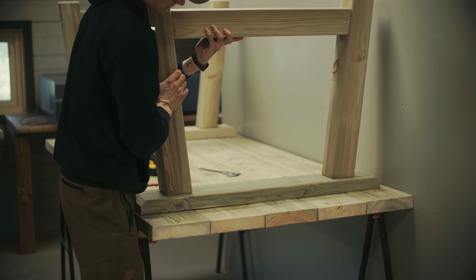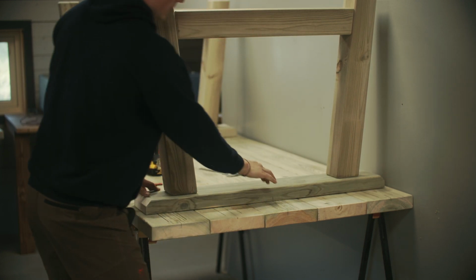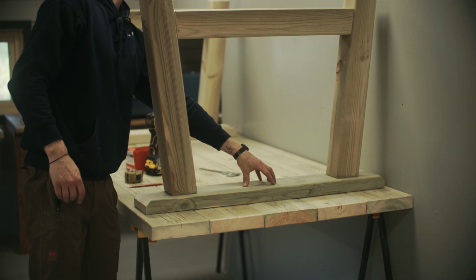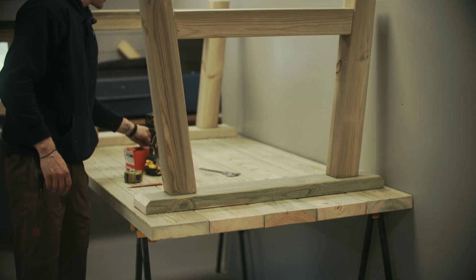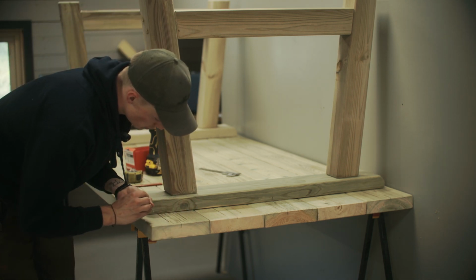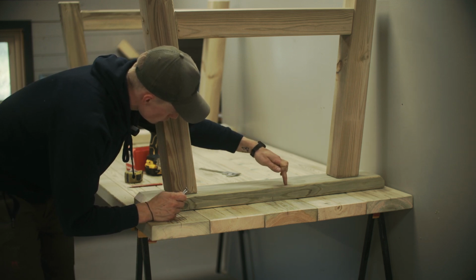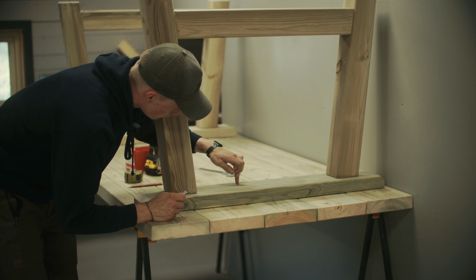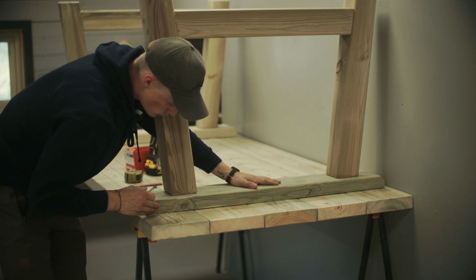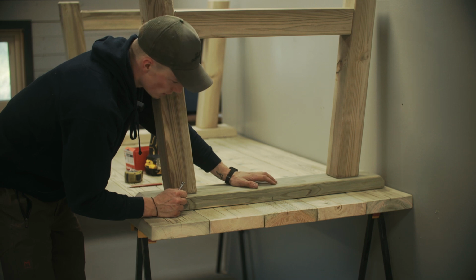I'm going to put it on the line, and now we can start to attach the middle board, and I'm going to use 80 millimeter screws, just making sure that they don't go through the tabletop, of course. And I like to use 4 screws into each board. So that is 20 screws in total on this side and 20 on the other side.